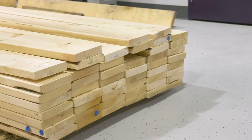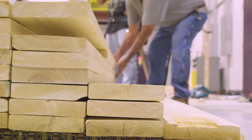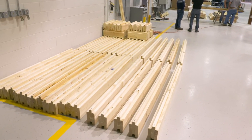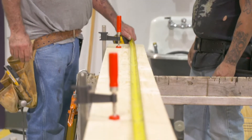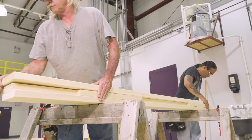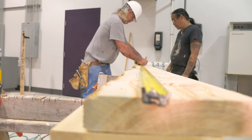In the previous video, 133 of the 169 total 2x8s needed for the project were used to construct the beams that made up the walls of the safe room. The 36 remaining 2x8 boards are used to construct 12 beams for building the ceiling. None of these 2x8s had their length cut — they must remain 8 feet long so they span the full width of the walls.